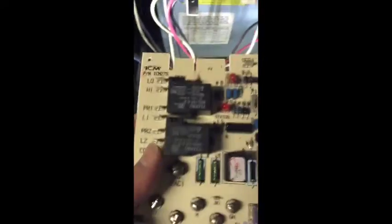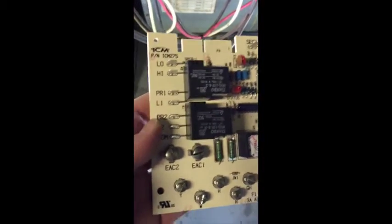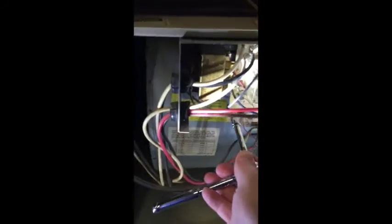So, take it out of the box. And as you can see, pretty much everything that corresponds to the board there corresponds here. You can see that little white piece. These two will stick up into that slot and then screw on in one or two places at the bottom, and that's what holds it in. So like I said, I'm going to pull each wire out and put it onto its corresponding place on this board after I take it out. Probably don't want to throw the board on the ground like I just did. That could cause some problems.